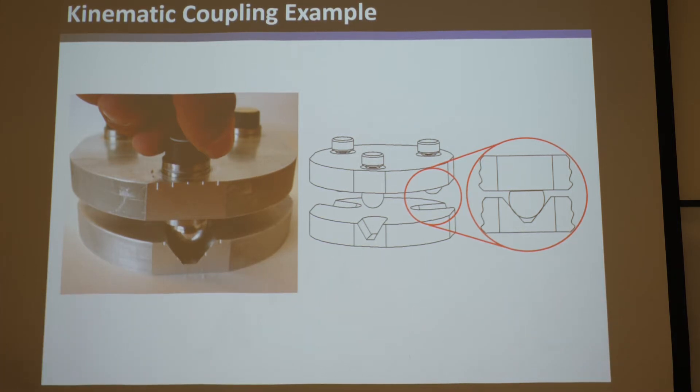The wheels are oriented so it can rotate over large ranges without scratching or having friction - it just reduces the friction. You can see how these principles of exact constraint design can be used to design rigid systems as well. Another precision thing you absolutely have to know about in a class about precision are kinematic couplings - a great machine element that you should know about.